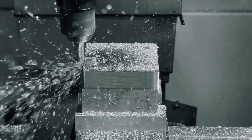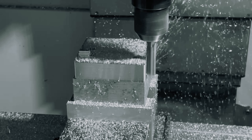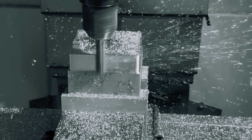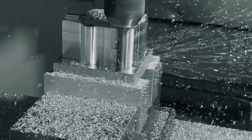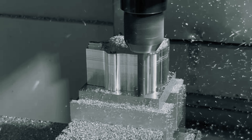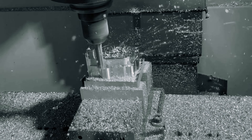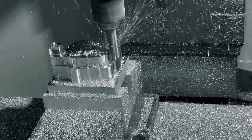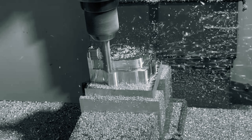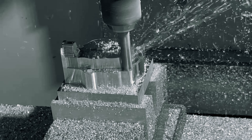I'll be honest — the first time I ran one of these I was pretty nervous. The ZK60A magnesium alloy T5 was spooking me. I did my research and learned it had a zirconium and zinc content, and I really didn't know how it was going to cut. But as you can see in the footage, it was just shooting huge rooster tails, cutting beautifully, and sliced through it like butter. No issues, no galling of my end mill — it cut really nicely, better than 6061 even, I think.